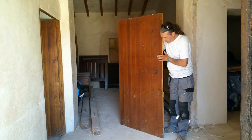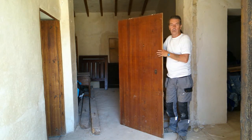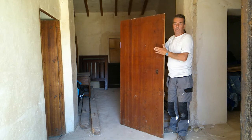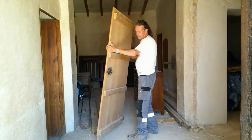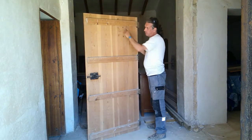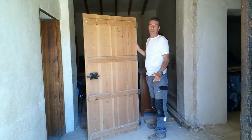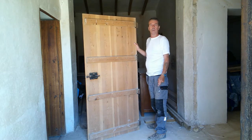This is one of the original doors of the house — it's the bedroom door from the wall that we took out. We're going to be reusing these but we don't have enough doors for upstairs, so we've made that door exactly the same or very similar. It's just a straight ledge door. We only put three ledges in to keep it within the same character as the house, as we want to retain as much of the individual unique character as we possibly can.